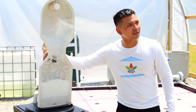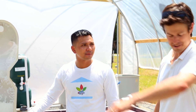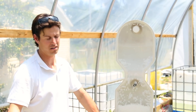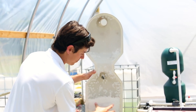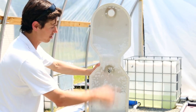This thing does it by itself with a turn of a knob and unplugging a pump — that's it. That saves aquaponic growers valuable time, and it doesn't get any cleaner than this. We have a good saying: you can backwash this filter wearing a tuxedo if you wanted to. We could do all kinds of things with the solid waste on the beads — drain it to a five-gallon bucket, mineralize it, drain to a land-based garden or fruit trees. But the point is: trap it on the beads, then get it out.